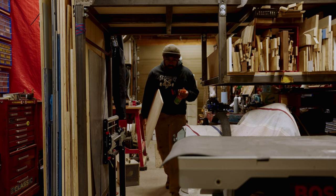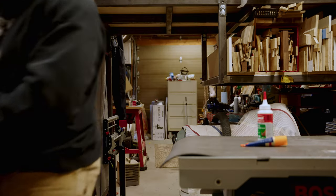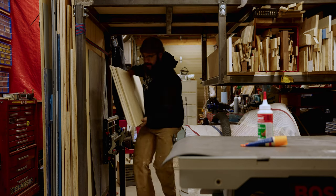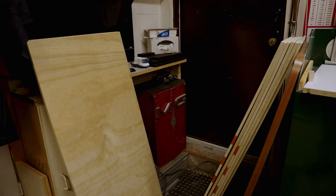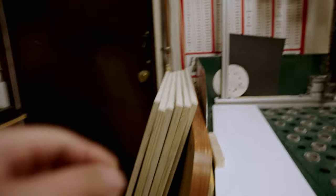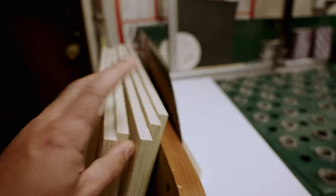For the materials of this project, I used half-inch Baltic birch plywood that was pre-finished on each side. This means that the surface of the wood is sanded, which cuts out a lot of the work in the finishing process. You could easily use three-quarter material here, but I thought the half-inch would be strong enough and it helps reduce the weight as well. I sourced my material from a local Home Depot, and when making projects with predetermined cuts, you can easily get the majority of your cuts done there at a small price.